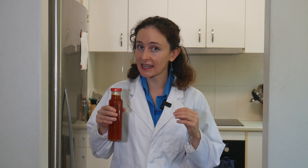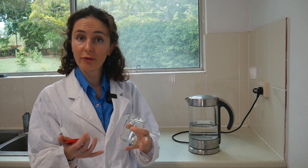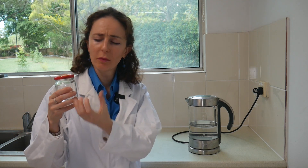This tight seal is made with two primary methods: first, mechanical vacuum capping, where the air is sucked out of the jar during capping; and steam flow capping, where a jet of steam is pushed into the headspace during capping. Mechanical vacuuming just makes sense — you form a vacuum around the jar, cap it, and then when you remove it to a normal environment, the low pressure in the jar will continue to suck the cap onto the jar.